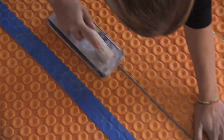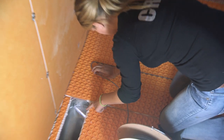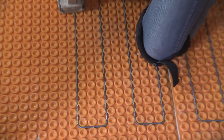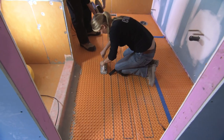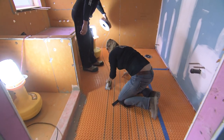The great thing about the cable is it just snaps into place in between the pucks. It's very simple to make changes — if we need to rearrange the cable, we can pull it straight out and realign it in whichever pattern we need to accommodate the floor warming. I like how fast we can install this: simply adhere the Ditra Heat to the floor, and once that's dry, snap in your cables, which takes about 10 minutes, and you're ready to tile right away.